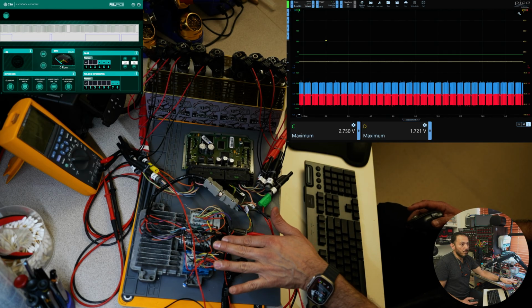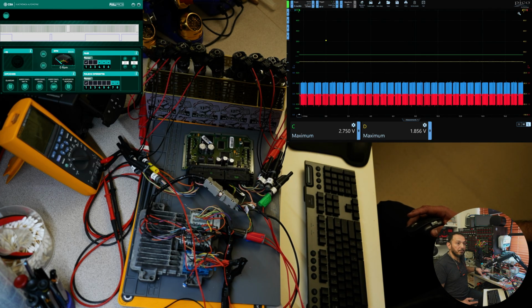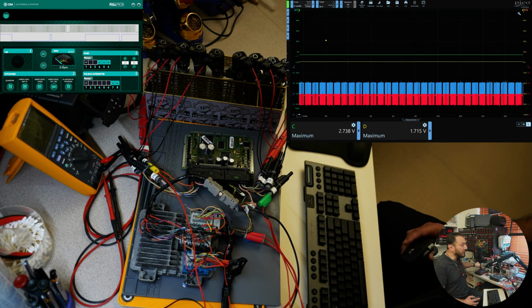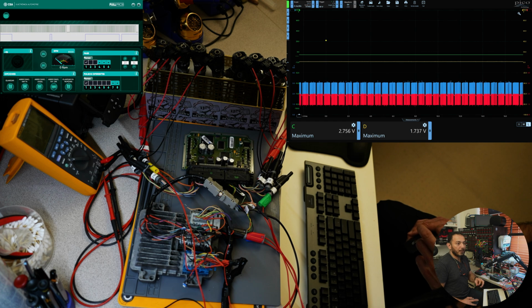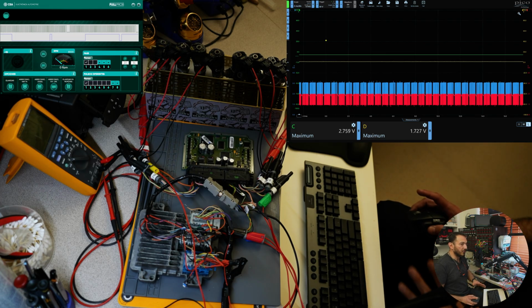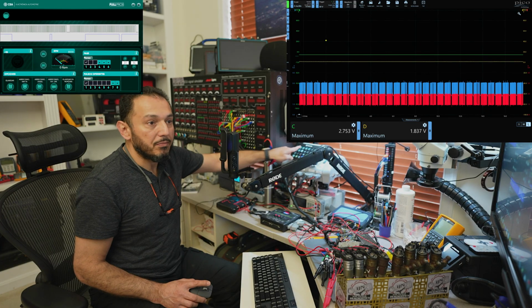And I have my own computer in here. This is my own stuff. I also have the BCM, which is very important because it has a key, and realistically, I don't need a key. All I have is a resistor in place in the BCM. I performed a relearn with that resistor, and I don't need any keys. I don't need anything, and it's working really good. That's what you see here. Let me just move you over to the big screen.